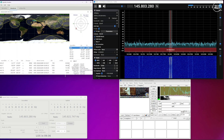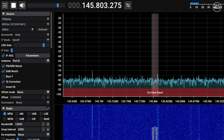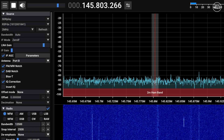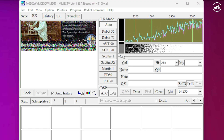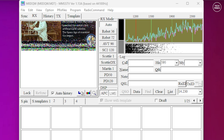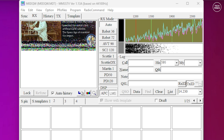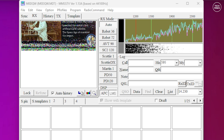The SDR software I'm going to be using is the latest nightly build of SDR++, and I just need to make sure that I have the narrow FM modulation type selected. Using a virtual audio cable to route the audio output from SDR++, we route that audio to an application called MM-SSTV. This software is a free downloadable application and will convert those SSTV audio sounds to an actual image. If you haven't heard what SSTV sounds like when it's being transmitted, this is what it sounds like — at least for PD120.